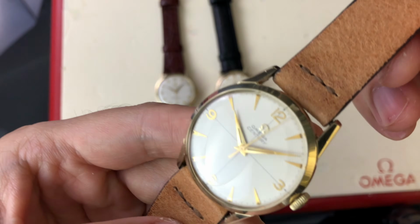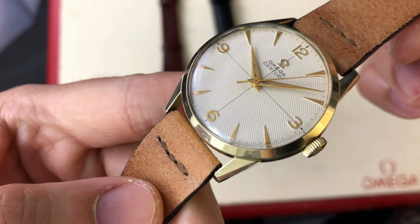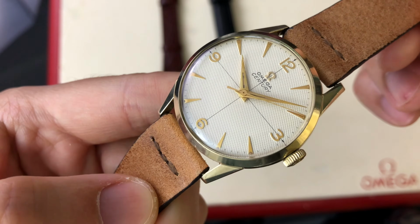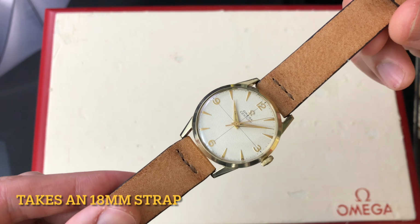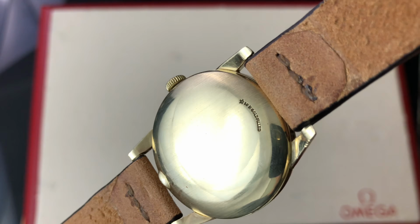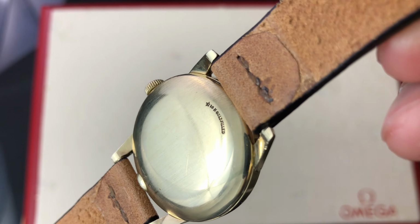There are a few other Century models throughout the 1950s and 1960s. Some of those models are entirely Swiss-made and do not carry a Star Watch Company case. The Century case is made of 10K gold-filled. The case dimension measures 33.3 millimeters in diameter, excluding the crown, by 39.6 millimeters from lug tip to lug tip.